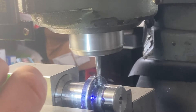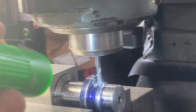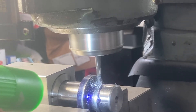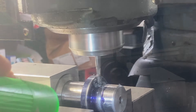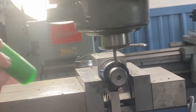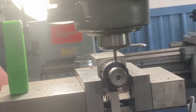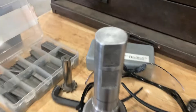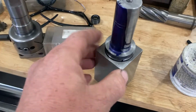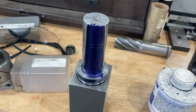I'm going to take several passes to do this. The key seat is finished. I've got a couple of rough scribe marks on here for the flats — those of course don't need to be super precise. I'm going to load this up again in the Bridgeport to cut the flats, then we're on our way — all we're going to do is single-point the thread diameter, then be ready to make our nut and put this together.